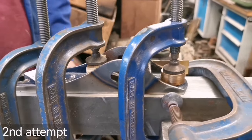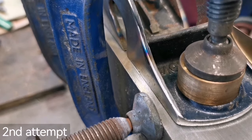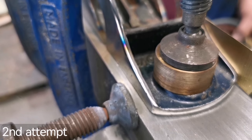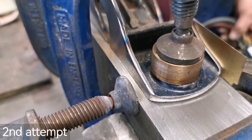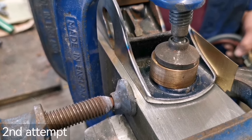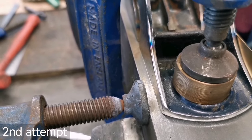What you don't want to see is bright red, and you don't want to see yellow, because that's getting a bit too close to the plastic state. I know we talked about this previously, but I would have been guessing as much as you are by how much spring back we've got. So we did a 0-0 test and got 6-8 thou spring back that way, and 3 or 4 thou, not pulling the front down. So we needed a reference from which to work, and hopefully this 12 and the 6 underneath will get us a little closer to perfection.